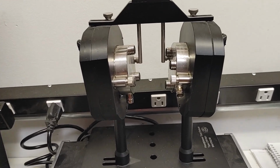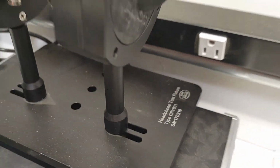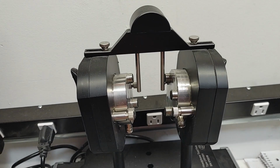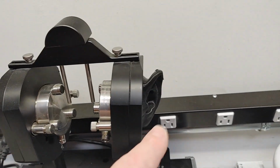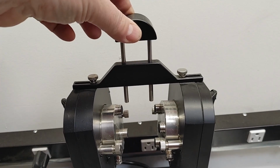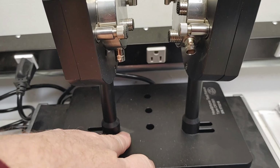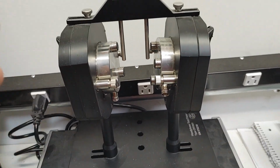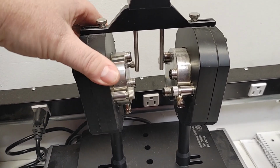Instead of that, I use the Type 801, this thing, from Crysound. There you go. 801. It's got a pair of 711 couplers. Remember, I covered those yesterday. Those are for the in-ear canal simulator kind of things, right? It's also got rubber ears on the side, but it also allows you to adjust the height. So I can do a tall head or a short head as I want. I can also loosen these things up and push it in or out. So right now I've got it set for minimum head width. I can set it to the wide head width. I can also change the side. Is your head oval? Is it fat? Whatever needs to be done.